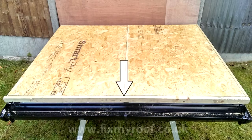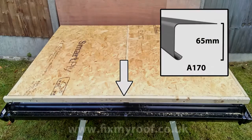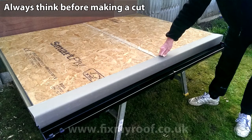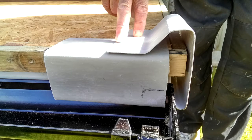At the front of the roof deck I will be fitting the first trim, which is the A170 drip trim as seen in the last video. This trim is cut to size and ready to fit, but before fitting a full size trim I recommend cutting off a small section of both the drip trim and the upstand trim. This way you can offer them into place first and get it clear in your mind how the trims will sit and work together. This could save you an expensive mistake.